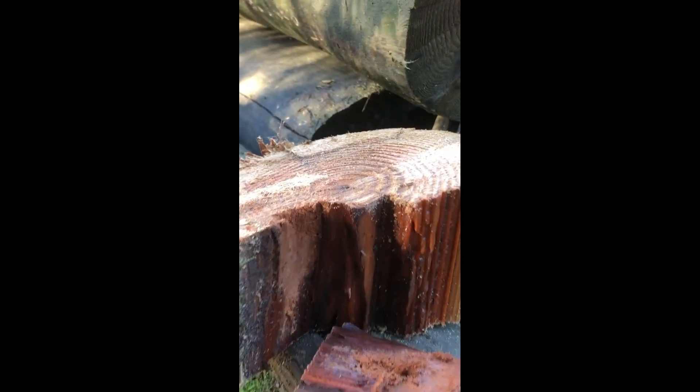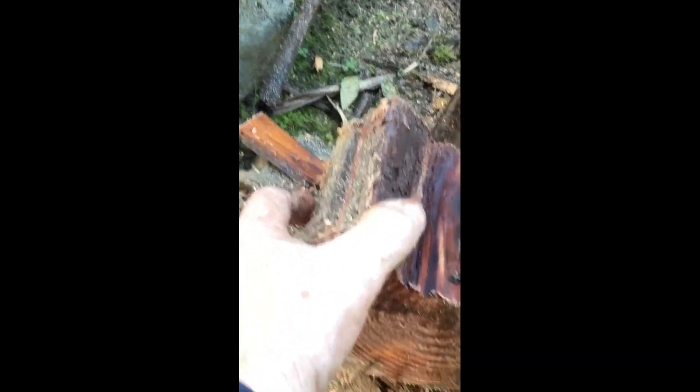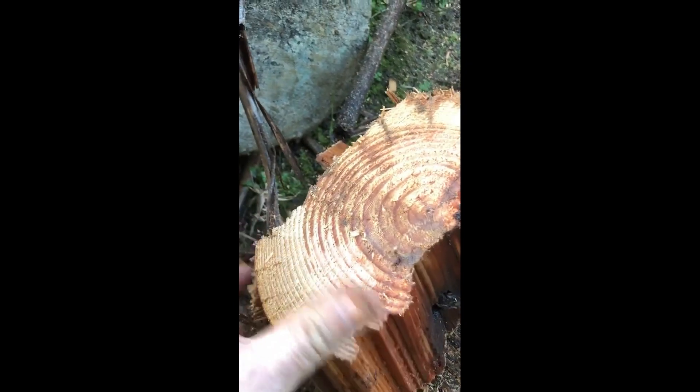Now I've chopped a fair bit of this pole up — that is about maybe a couple of meters from the head of the pole. That bit there and these bits — a couple of meters from the head of the pole you can see the crack forming straight through this particular leg. That's a real problem, and that's why larch poles should never be trusted. They rot from the inside out.